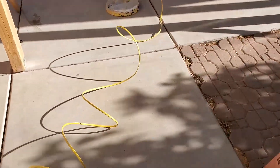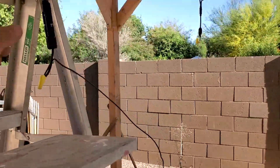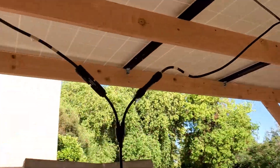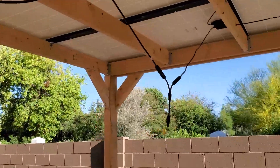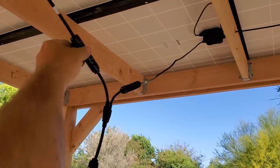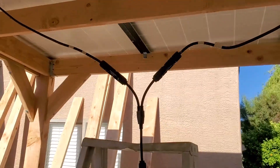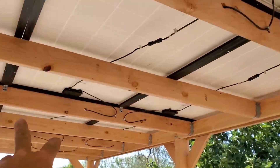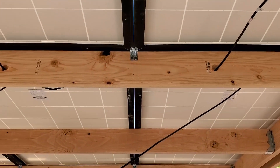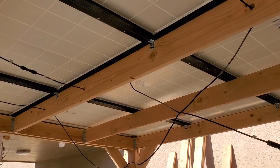This is how I have it rigged — this is a 100-foot roll. I'm gonna put a disconnect on this by the way; this is just temporary. I just have positive going over to the two positive feeds because it's parallel, and then negative over here to the two negative feeds. Got 10 and 10 in series, each bank, and then the two series banks of 10 are in parallel.